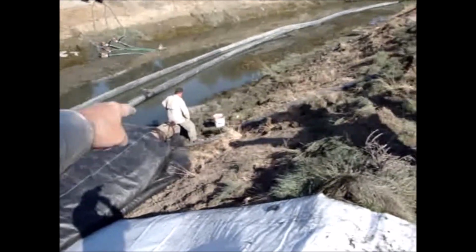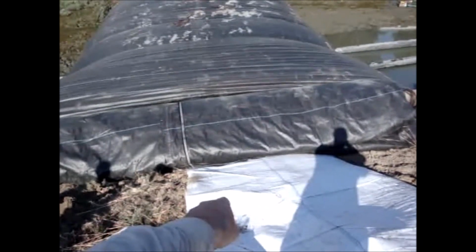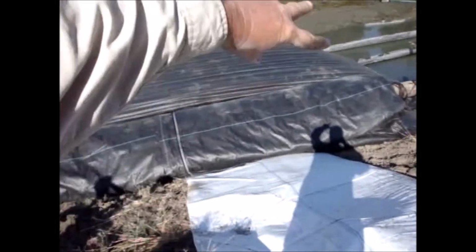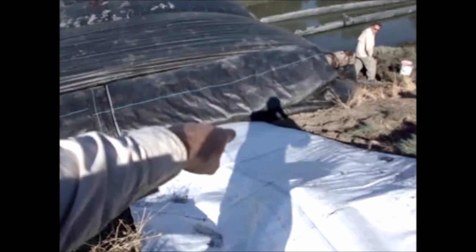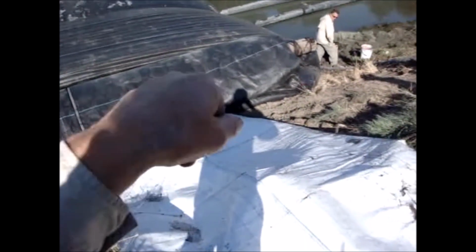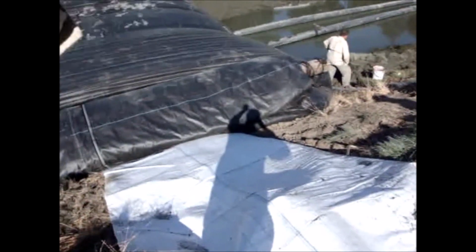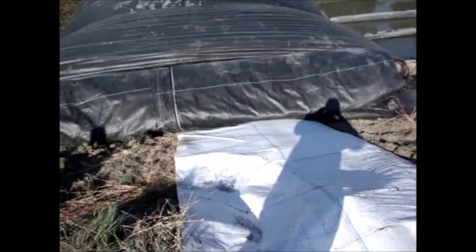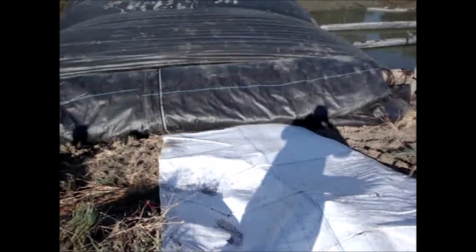We've now started a fifth pump. It's pumping into the seal-off dam that's underneath the two flume pipes that run underneath the AquaDam. So we start putting a little water here, and that will go underneath the big one to directly underneath those two pipes. That's the only space down there for it to get to.